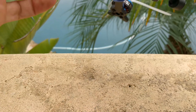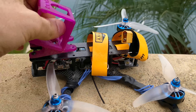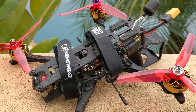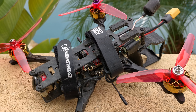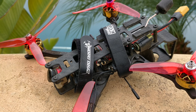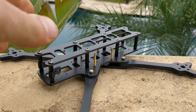This particular layout is a dead cat layout, and I have the dead cat arms available on FPV Cycle for all versions — six millimeter, five millimeter, and 4.5 millimeter — which you can mix and match. The dead cat arms are simply wide front arms to get the props out of view of the GoPro. If you're running a session camera, you still need about 20 degrees of tilt to get the props out of view. Dead cat arms actually don't impact flight performance all that much — it's really just a touch of performance difference.